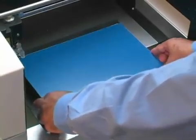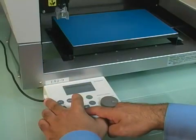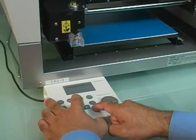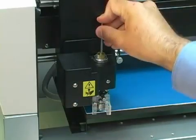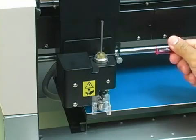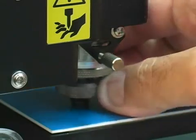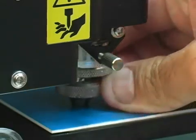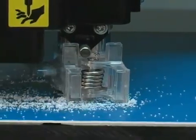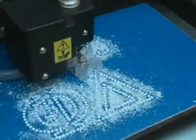Load the material. Using the control panel, move the carriage into position for engraving. Load the engraving tool and adjust the nose cone to the right depth. For just about any stone, we recommend a depth of 0.5mm. Now you are ready to output your file. It will take just a few minutes for the EGX-350 to engrave the template.